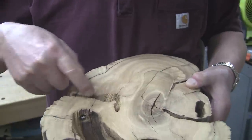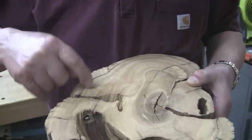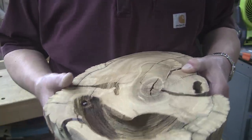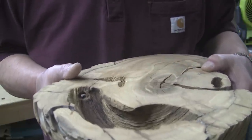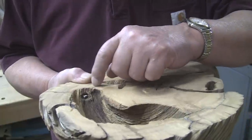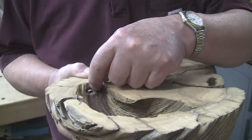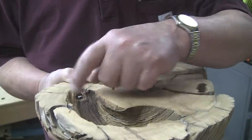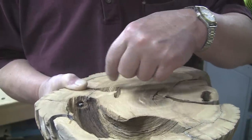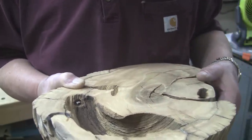So he put two three-inch screws in it — that's never occurred to me to put a screw in a bowl I was going to turn. So I got to looking at it and mostly this seems to be pretty well attached now with glue. This crack was separating this part from this part, so I drilled a hole with a combination drill bit that drills a hole and countersinks at the same time, and I ran a three-inch screw in there, but it didn't sit down far enough inside the countersink.